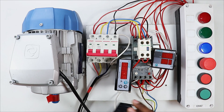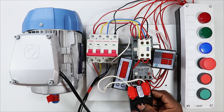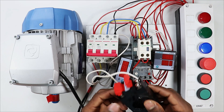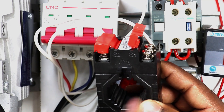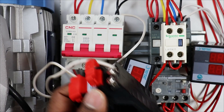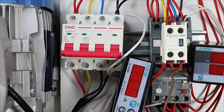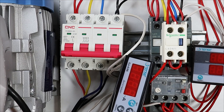Now we only have to connect this CT with the phase supply. The current should flow from inside this CT — only then our CT will detect the current. So I am removing the phase supply wire from here, and after removing it I will see where P1 and P2 is written on this CT. As you can see, P2 is written above this CT. P2 means the output of the power supply should come from here — so the phase supply will enter at P1 and come out from P2. So I insert this wire inside it, and after putting it, I am connecting this wire back here.